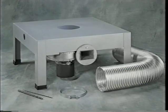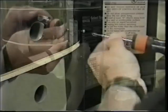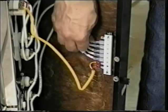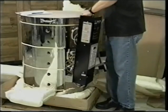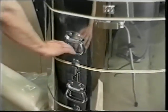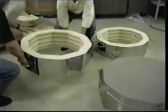Consult your kiln vent manual for specific instructions. The electronic control panel has a hinged box for easy removal. Remove the attached screws on the left side of the panel box and swing the panel to the side. Slide the connectors off of the terminals — notice that each wire is labeled with its corresponding terminal connection. Also slide the thermocouple connector off the terminal strip, then lift the box up to remove it. After unfastening the alignment buckles, with the help of a partner, lift each section of the kiln using the lower section handles and place them on a clean, level surface.